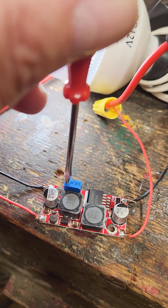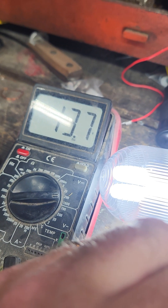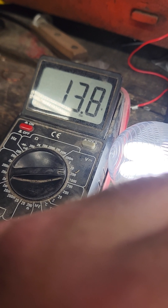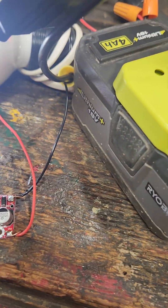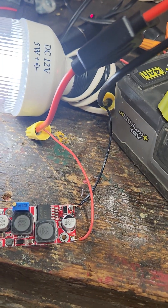It's about 13.8. It's real easy to adjust — you can see this right here. I'm gonna turn that a little bit; you can see up here as I turn it, it's easy to take the voltage up and down. Turn it back to the right. I got 13.8 and that's where I want to leave it. That way it will run most 12 volt stuff really good.